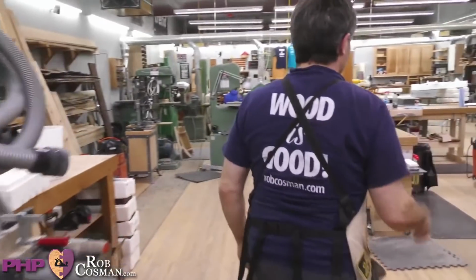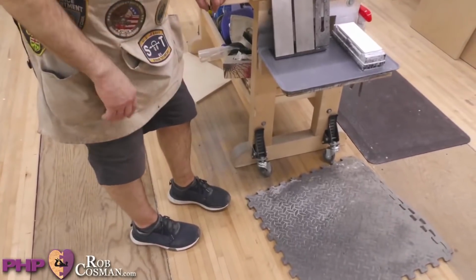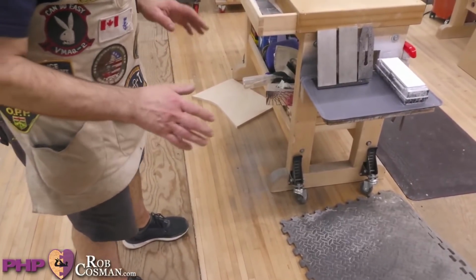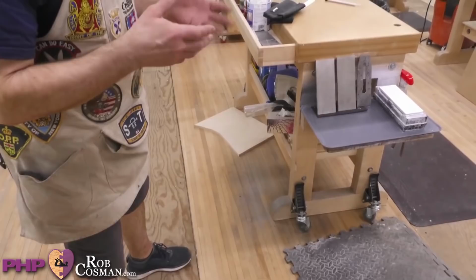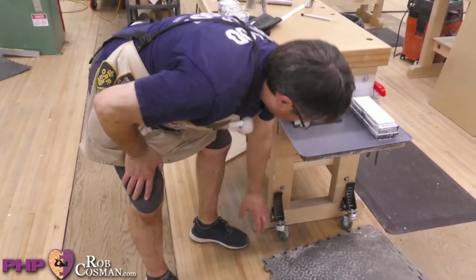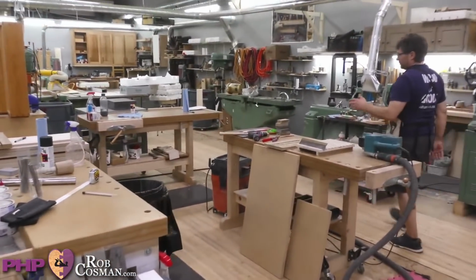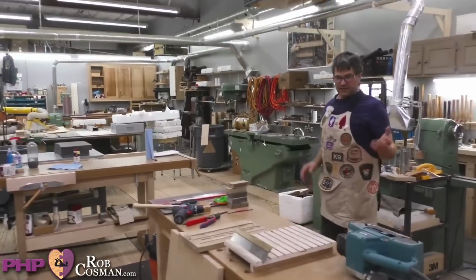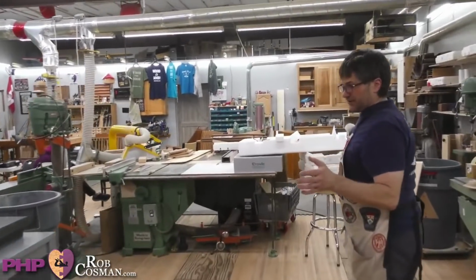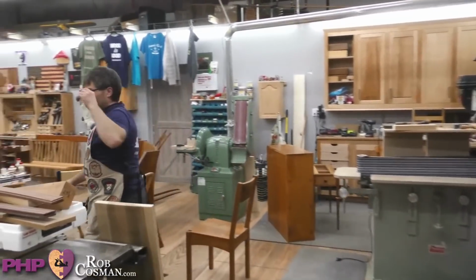Oh, and then the biggest thing, all of our casters. These casters are wonderful if you have to be able to move your bench around. But the problem is, as they come from Woodcraft, they are too thin. If you're moving your bench and hit the first little bump, the casters bend and then you can't use them. So Willie takes them and welds on an extra piece of steel, grinds them all off, paints them up, and now they work fantastic. We really have some of these benches loaded down and it never bothers them. We only ask him to do about 10 of those a week, so if you've been waiting for a set of them, please be patient. We can't wear him out. We don't even have them right now, so that's another reason you need to get better, Will.